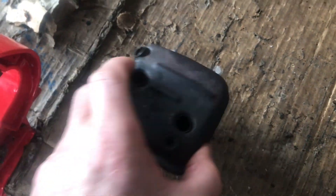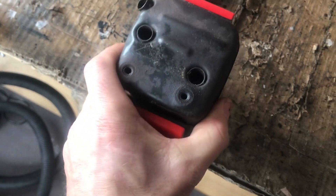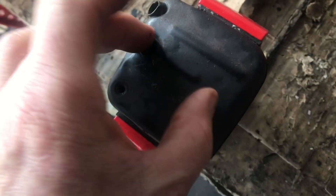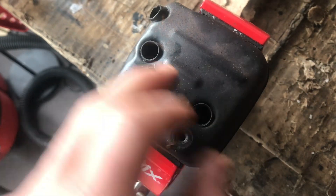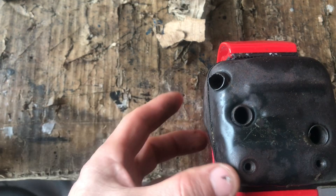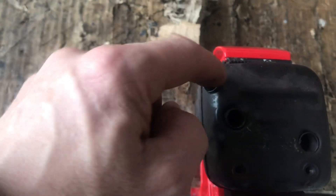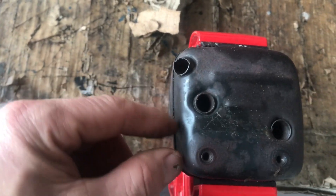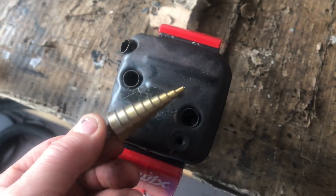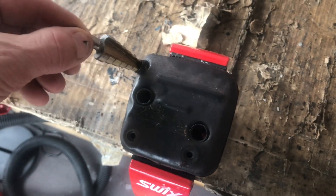So let me mount that. This is actually from the skis but it will hold it. I'm just going to hold that in there and then drill those out because they're actually welded, as is that one. The reason we're drilling that out now is because once this thing gets cut up a bit it's very flimsy and you can't then drill it out until it's soldered, welded, or braced back up. So what I'm going to do now is drill that and that and that out.